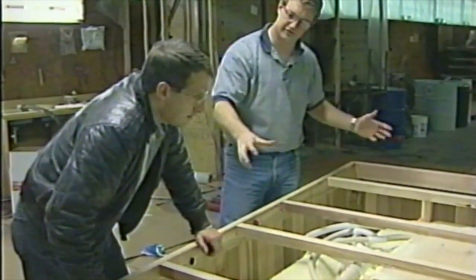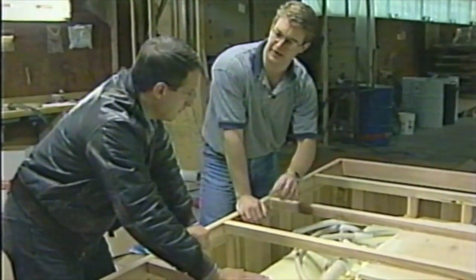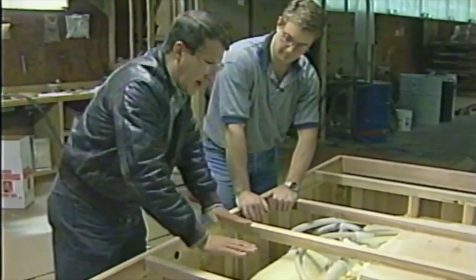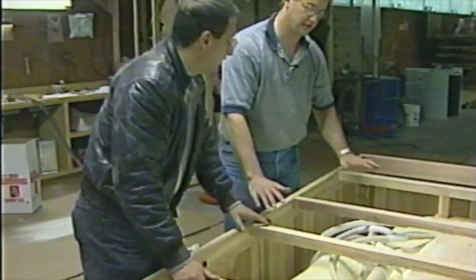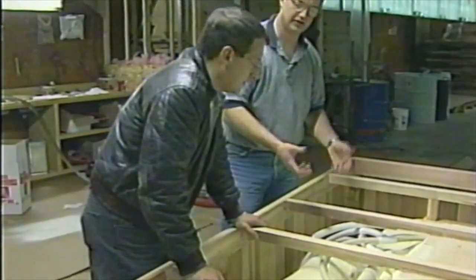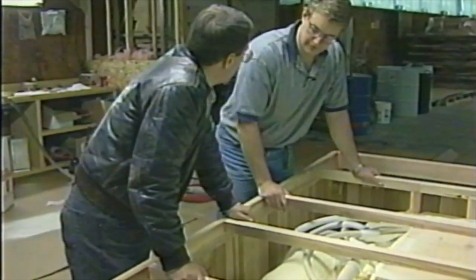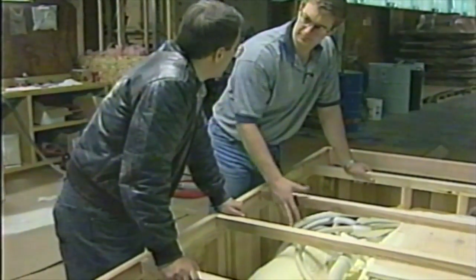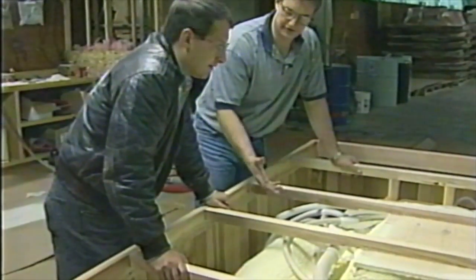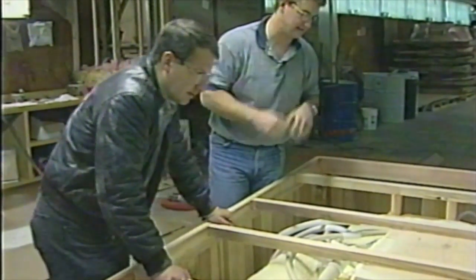Once he does the walls and around the lip, then he's going to fill this cavity, all these holes that we have in it, with a 1/2 pound, really soft foam that you can put your fingers down through. This is going to be just solid, everything filled. Yep, we're going to pack the whole thing with insulation so we can maximize our energy and our efficiency in keeping it heated. Then you don't ever have to worry about any of these lines freezing in the wintertime. Plus they're going to be held in there. Yeah, they'll be fully supported. They can't come out of any fittings or anything. Well, there's still the possibility of leaking, but it helps alleviate that possibility by holding them all tight together.